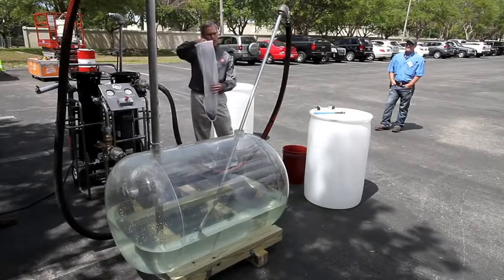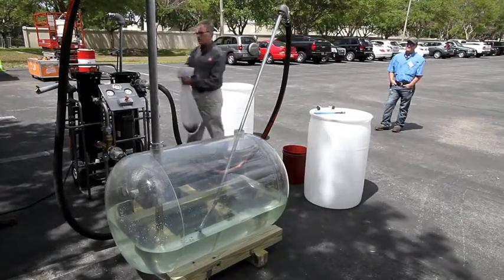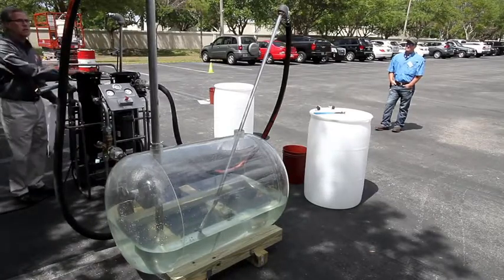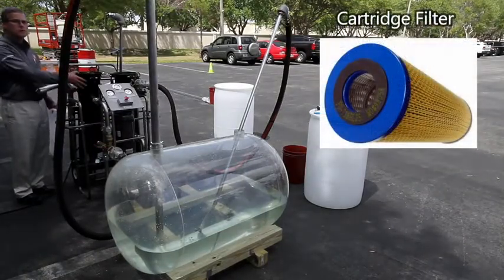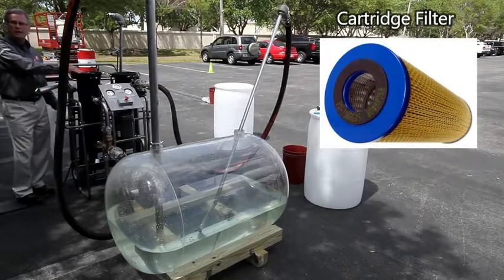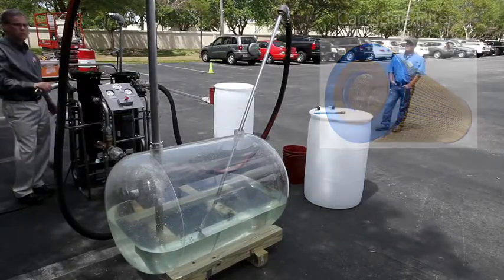Until you get all your debris out, you have a large micron at first and then you get down to something smaller — finer and finer. With this unit you can isolate the cartridge filter while you're doing the large particles with the bag filter. And then when you're ready to get down to the smaller micron and use your cartridge, all you have to do is engage the secondary canister with the valve system. Now you have not only the bag filter going but also the cartridge filter going.